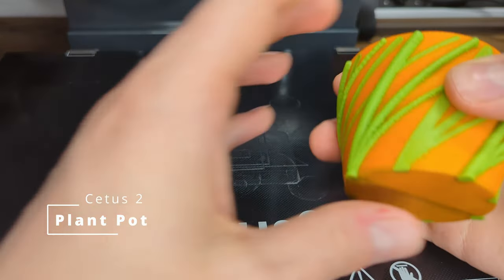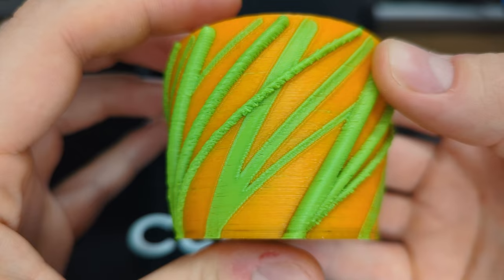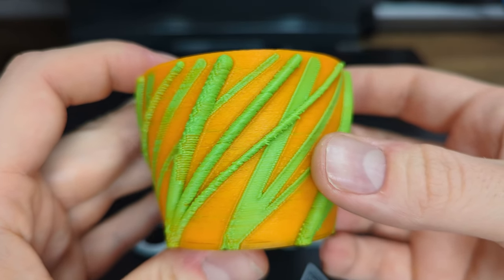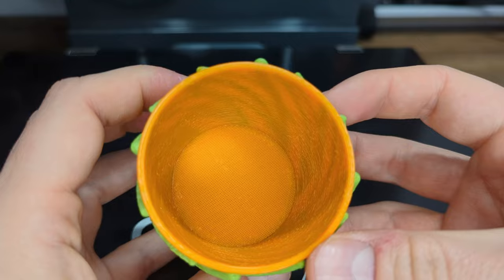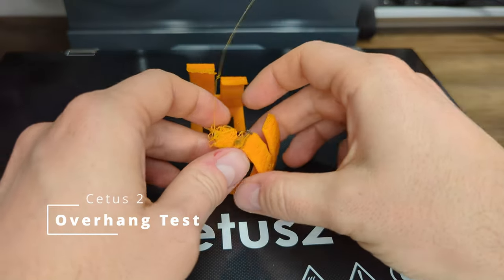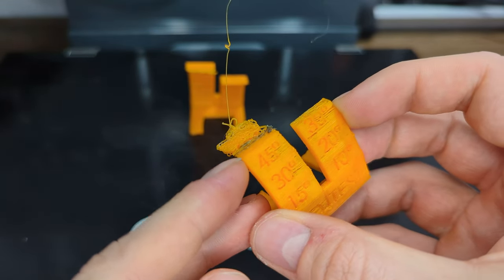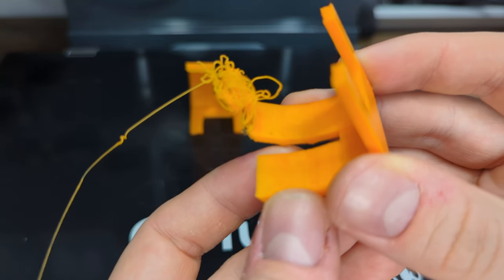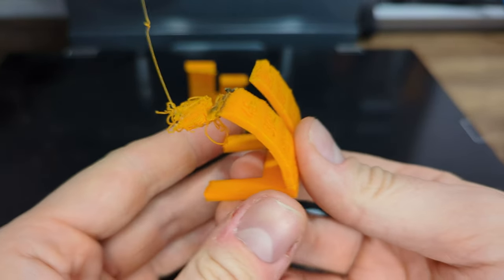Now that I know blending is not the way to go, I looked for a two-color model and found a nice plant pot. At first glance the print looks very nice, but as soon as you look for details you notice fallen lines all over the relief. I went to my girlfriend and asked if she would like to use it for a new plant, but she declined. So I went out to test the part cooling with an overhang test. The first overhang test failed at about 30 degrees, which was the worst result I've seen on a 3D printer with part cooling enabled. Also, the area behind the tower started to get rough at about 20 to 30 degrees — so even at 30 degrees, the cooling performance is not stable, which we also saw on the vase and on the rocket.